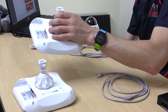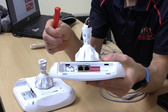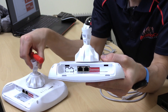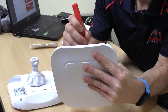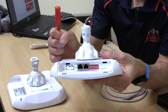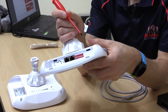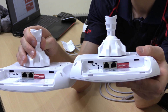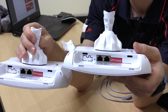Now programming our receiver. As this is a receiver, we do not set dip switch one up — we leave dip switch one down. However, we still need to match the dip switch settings for switches 2 through 8. So I'm flipping up dip switches 2, 3, 4, and 5 to match the other unit, and 6, 7, and 8 stay down. That's done. If you have multiple receivers you'd need to program dip switches 9 and 10 differently on each, but we're only using a pair. Here are the two units side by side showing the dip switch configurations.